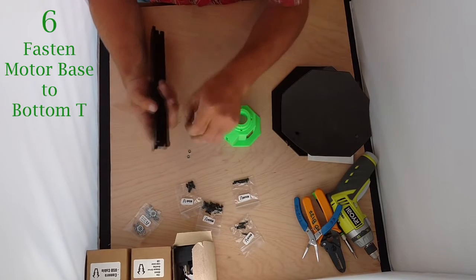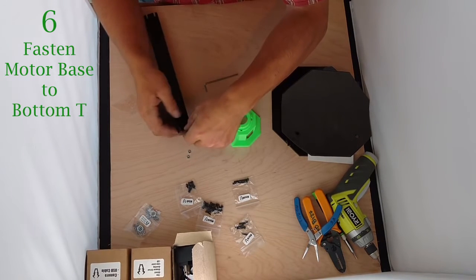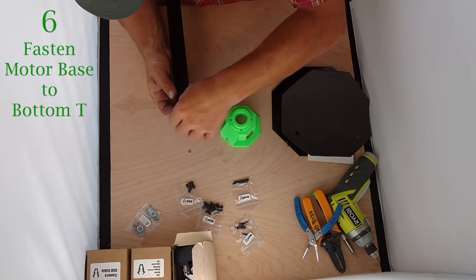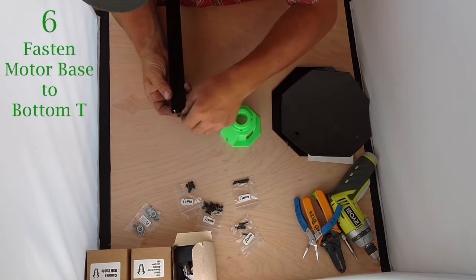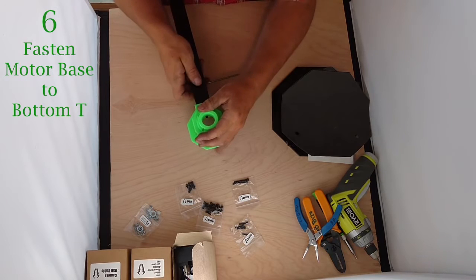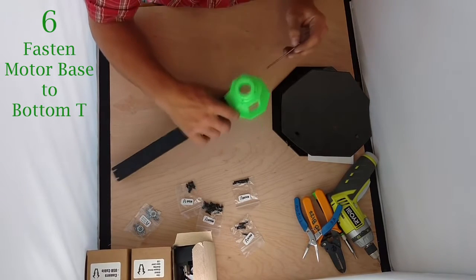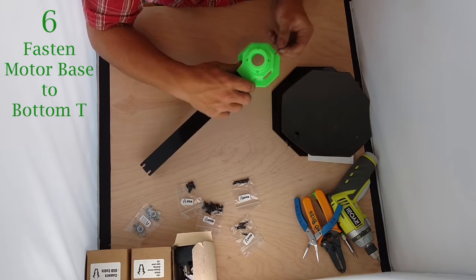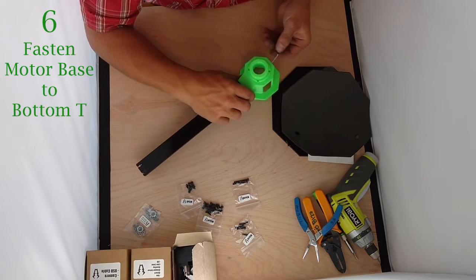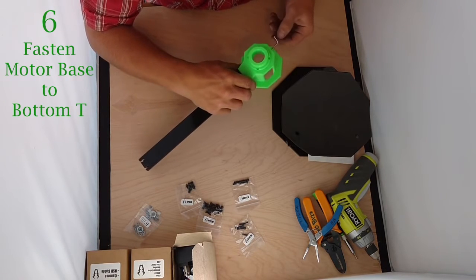It can be a little hard to hold the nuts in here, but if you set that first one in, it should rest, and then just use your fingers to hold the other two in. Slowly wiggle them on there — it should press in and you should be able to just barely see the tips of the T-slots. Stick the Allen wrench in and tighten up those nuts. Don't over-tighten — acrylic can be fairly brittle, and there's no need for things to be very tight. There are no fast-moving parts, so just snug is going to be plenty.